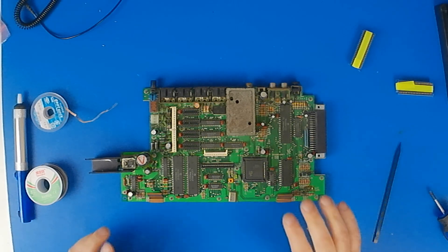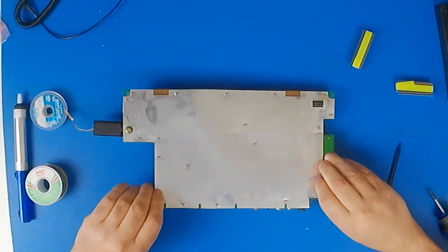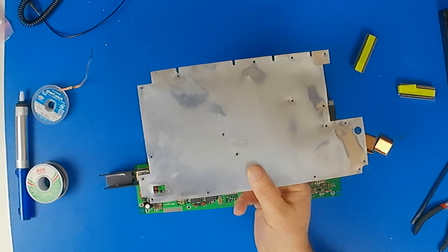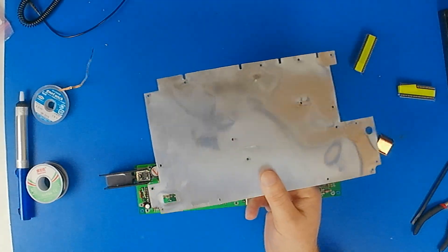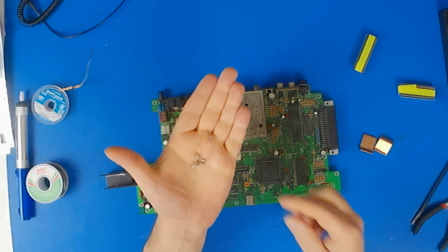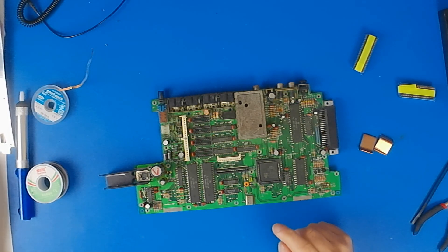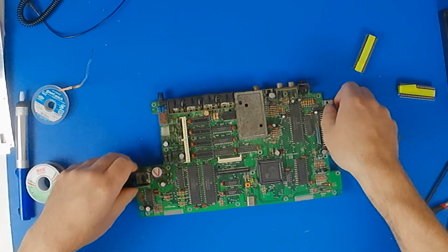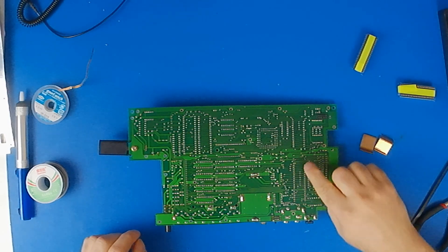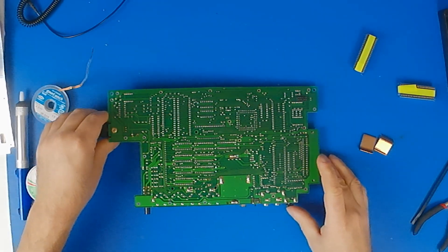Now there are a few less things to break when I take the chip off. It looks like I have some shielding to get off first. I have to say that was significantly easier than it was with the Commodore 64 — it was just taking a bunch of little clips off the board, all clipped in through these holes. So it is ready now for me to flip it over and look. It will be these two rows of pins right here that I have to desolder.